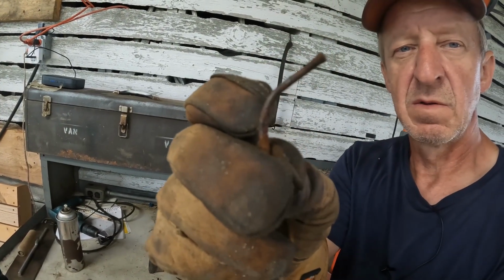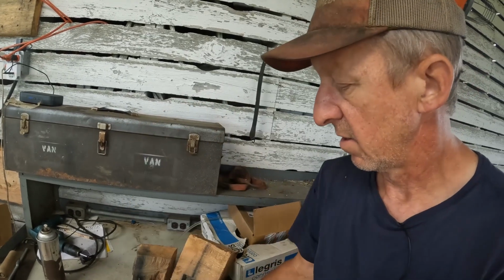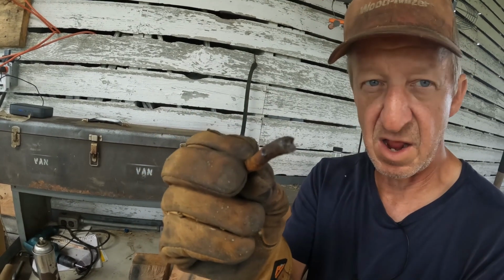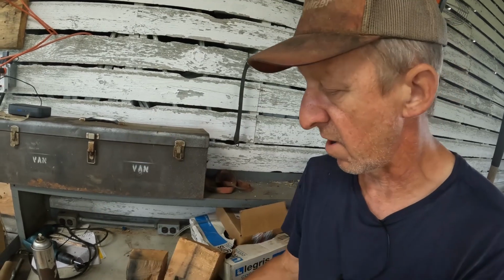that little nail right there. You see that little nail? Little bitty thing. Little bitty finish nail. That might not ruin a blade. You might be able to keep going with that blade, and you might be able to resharpen that blade. That blade, you're not going to resharpen that blade. If you do resharpen it, it's not going to cut right. It's never going to cut right again.